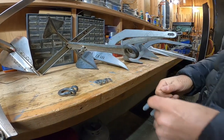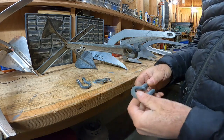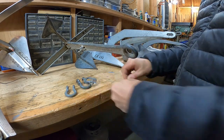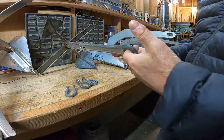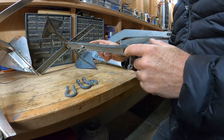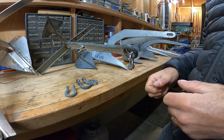Here's another North Hill — this one's galvanized steel at about 14 pounds. A 7/16ths shackle will not pass. 3/8ths will pass. 5/16ths will go, as will a quarter inch. Beautifully rounded — it's almost like the link of a chain. A very, very old anchor and the galvanizing is not perfect, but really, really great. It's another example of old galvanizing hanging in there a lot better than the new stuff.